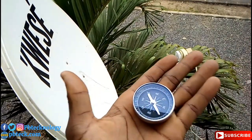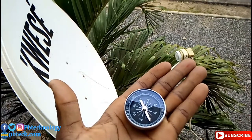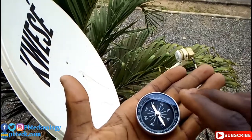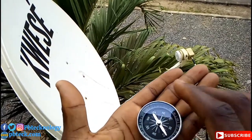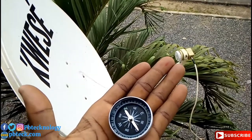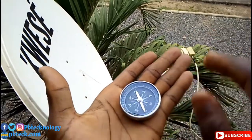Forget about the degrees, just know the direction you need to turn your dish, either on the east, on the west, on the south, on the north. So here DSTV, you'll get it on the northeast, 36 degrees. So knowing where your northeast is, you'll get your signal very fast.